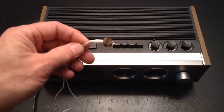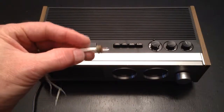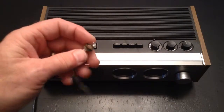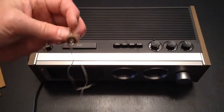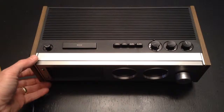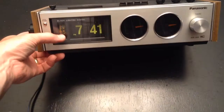This is an example of when I had a 12 volt 50 milliamp that I spliced in. What you have to do is use some shrink wrap to build up the size so that this grommet here holds onto it and keeps it in place. What I found was it lights up the indicator, but also the dial.